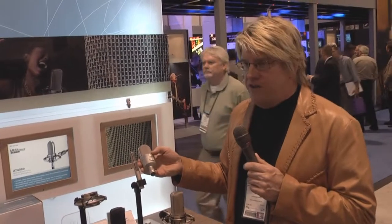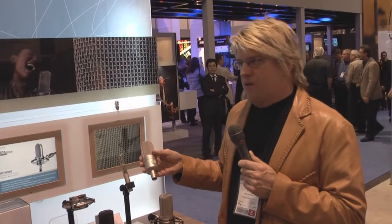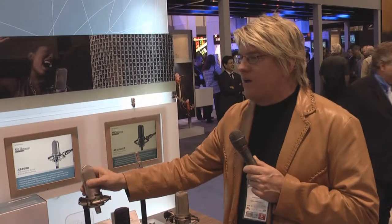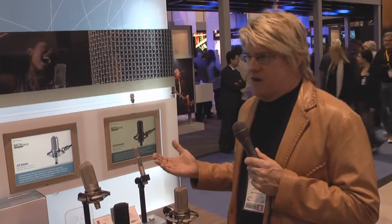The third thing that sets our ribbon microphones apart is, unlike the traditional ribbon microphone with a transformer output, our ribbon microphones have active electronics within the microphone to allow us to properly match the ribbon microphone output to today's modern preamplifiers and other input circuits. So all the impedance mismatch issues that you have with traditional ribbon mics go away. In fact, our ribbon mics actually require phantom power to operate. In the old days, if you put a ribbon microphone onto a phantom power circuit, you would destroy it. But our ribbon mics actually require 48 volts of phantom power.